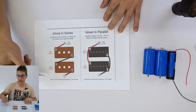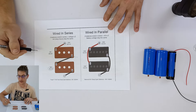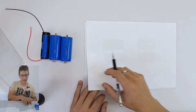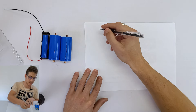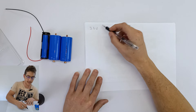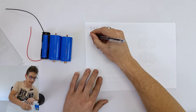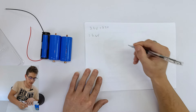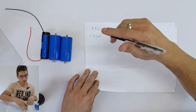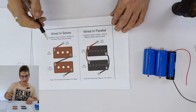Let's start by looking at the difference between a parallel and a series connection in batteries. This is going to be quite important later on. When we have a look at the chart I have here in front of me, it shows the difference between series and parallel connections, and I'm going to be demonstrating on live batteries just how it actually works. When you connect something in series, you're actually connecting the negative to the positive side, creating a common link between the two batteries.